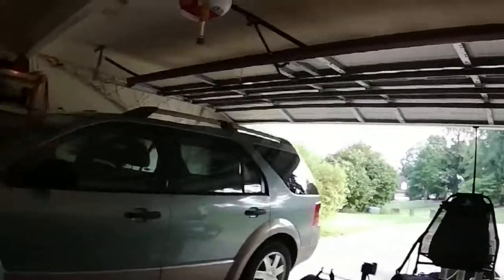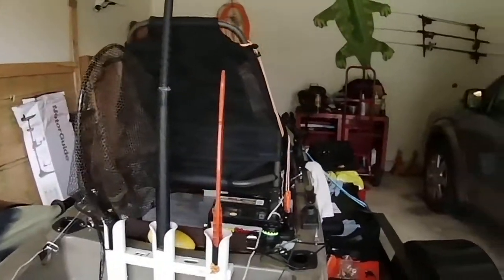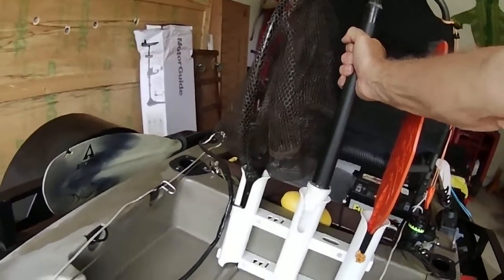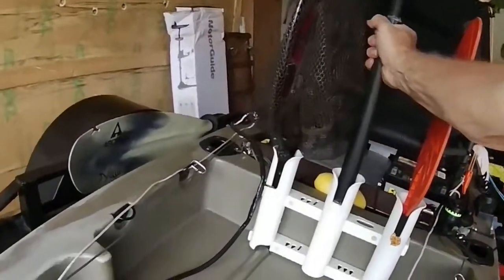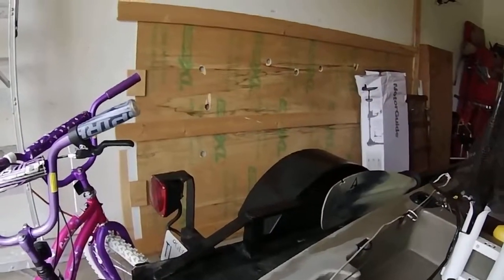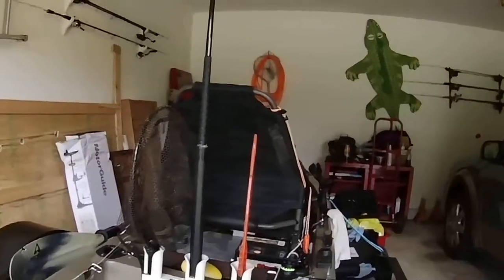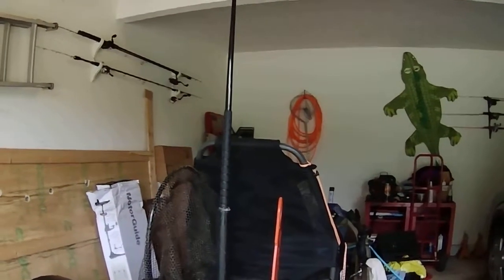There's a camera mount and another camera mount — I think I've just seen it behind me but never showed what I did. It's an old scope stuck into a piece — I think it was an old vacuum pipe. It comes out real easy — it's a little piece of PVC zip-tied to a rod holder. This cable will run up and I'll be putting quick disconnects on for these two. This runs up to the pulse width modulator, and then the battery. The other side will go to the pulse width modulator, which will have a 30-amp fuse and another quick disconnect. So that's what we've got going. Thanks for watching.